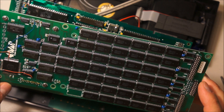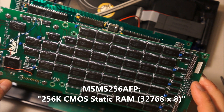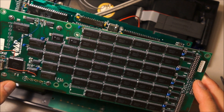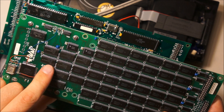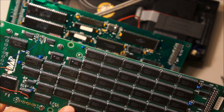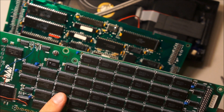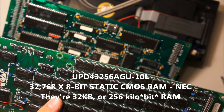These are M5256AP. And then these are all NEC parts. Actually, the M5s are Motorola and these NEC parts are D43256AGU. I wonder, because that can't be 256K, because the system only has 640K of RAM and according to the back about 800K of disk space. So in this case it's static RAM — presumably battery-backed static RAM. I wonder what the unit these are in.